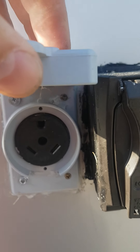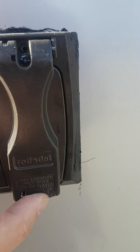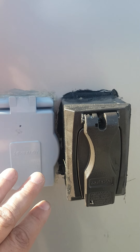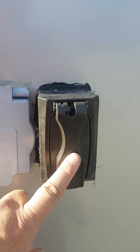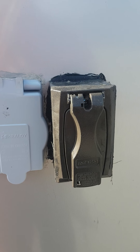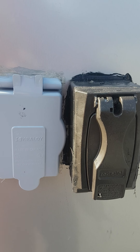I have a 30 amp outlet here and a 115-volt 15 amp outlet here. The reason I keep them separate is because if I want to install my air conditioner or heater, it will be on one side, and then I can connect the rest — like a TV — on a separate circuit.